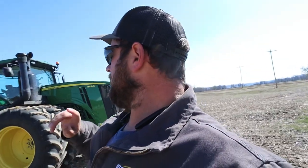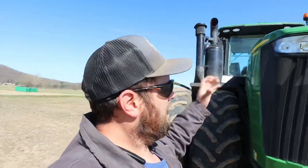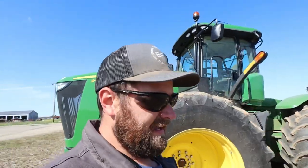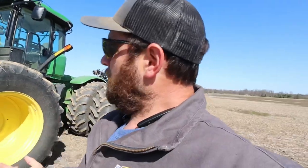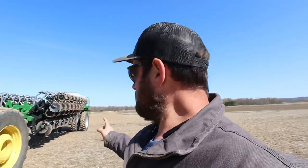So this is quite a bit later in the day. We had to go close on the sale of the mower shop - that is no longer our building, it is sold. But now we're going to tune this tractor. This 400 horsepower tractor has the 13.5 liter John Deere engine - it is the smallest horsepower rating on that engine of this year. This engine goes all the way up to a 560 horse tractor, basically identical other than a couple minor differences. The cooling capacity is not quite as big on the 410 as the 9560. But I think we can comfortably tune this thing up another 100 horsepower and have no performance issues whatsoever. As you can see behind me this strip till bar is massive - we're going to need a little bit of extra horse.